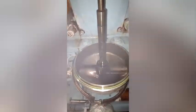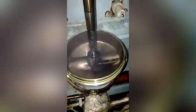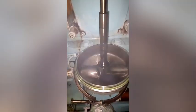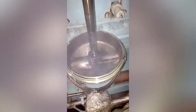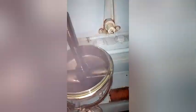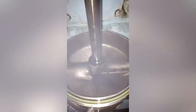from the unit. This long shaft you see is called the hollow spindle. It serves the purpose of allowing the dirty oil to flow up through it. It's more like an avenue in which the dirty oil enters into the system to be separated or filtered, whichever way you want to put it. And note, when you dismantle this part for cleaning, you should always use a clean rag to cover it so that dirt cannot enter into those pipes and block it. It may cause problems.